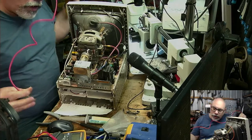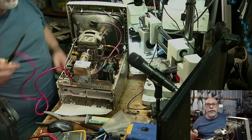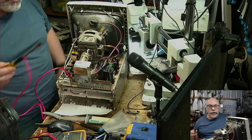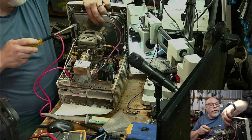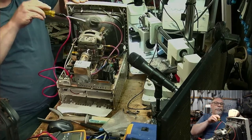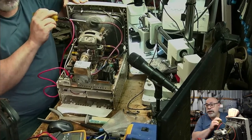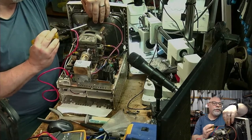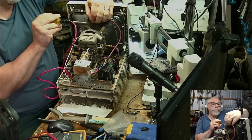Now, what do I always say about discharging? Disclaimer, very dangerous. Don't do it. But if you decide you want to do it anyway, I do have a video on my featured videos discharging a CRT in a compact Mac. So anyhow, let's just get this little guy in here and go clickety-clickety-click. No discharge there, nothing there, no voltage, no snap, no crackle, no pop. All good. So let's now take this anode cap off. Off you come.